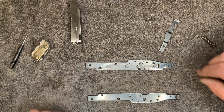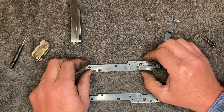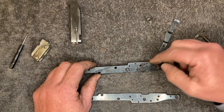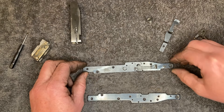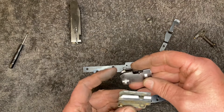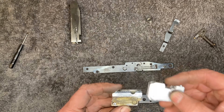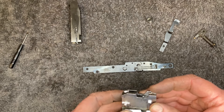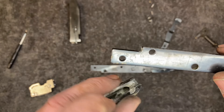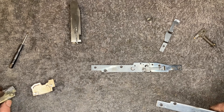Let's see if we can get it back together. Got the disconnector spring back in — that's why I took that big C-clip out, because the spring was disconnected and the only way to get it back in is to seat the disconnector. On the block: the old one has one pin on one side and two pins on the other side. I had two options — either remove a pin, or I just added a hole for the second pin on this particular block.